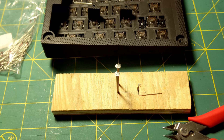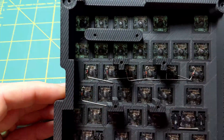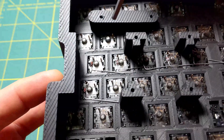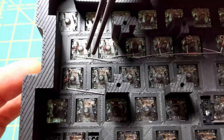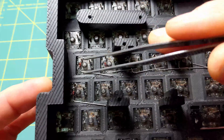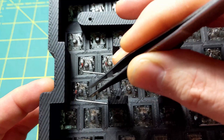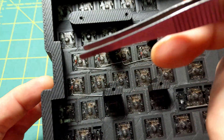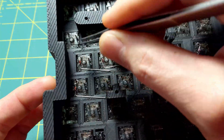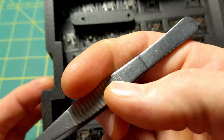When installing the diode rows, note that each key switch has two brass pins. I install across all the top pins for the diodes, and the other pins are used for the column wires. Diodes are very lightweight and jump around when you're trying to place them on the pins. A pair of tweezers — available for a couple of dollars on eBay or Amazon — is a great help, especially when bending and shaping the column wires.